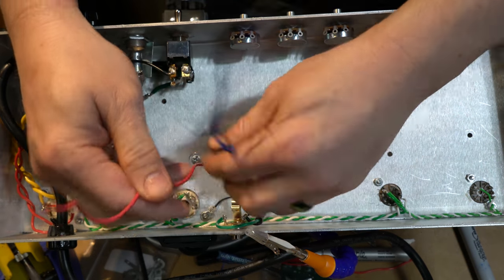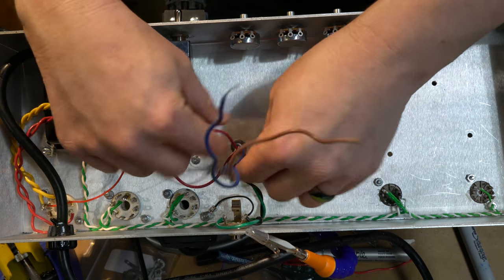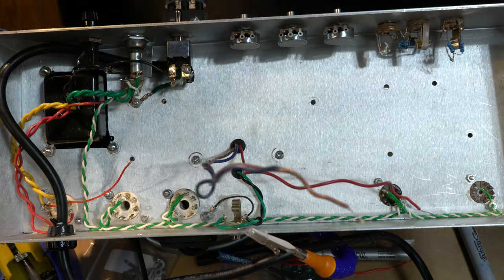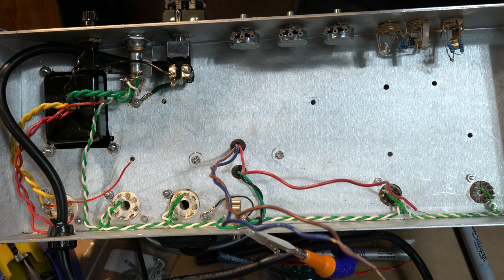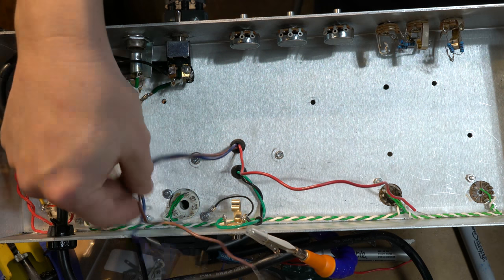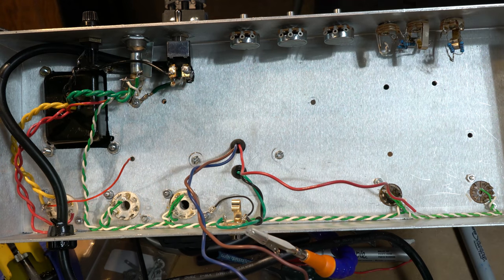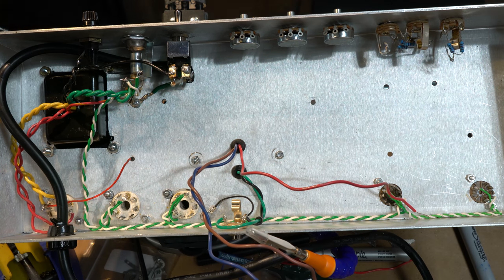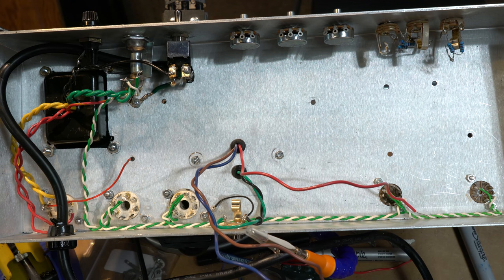Now, one of the things I learned early on in my days was that if the amp has global negative feedback, I don't know that this one does off the top of my head, I have to double check, but if it does, you want to connect these guys with a lot of lead wire loose, just to make sure it doesn't squeal and howl. I'm going to double check on the schematic, the color schematic, to make sure, because if it does have the chance of squealing and howling, then you want to connect it up to make sure it sounds good, and if not, swap those leads, and then shorten them down. So,